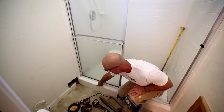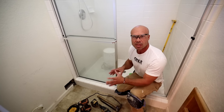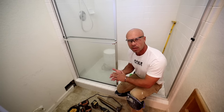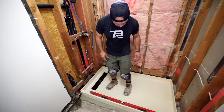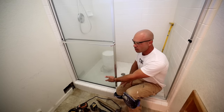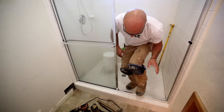What it also does is it'll crack the tile on the curb or the grout because the 2x4s making up the curb get wet and they swell - the tile can't give and it cracks. When we rebuild this, we're going in with a sealed system that has waterproofing directly under the tile so we don't get that wicking action. With curbs, I do not prefer wood curbs - I like to use either masonry or foam so that even if it had a little bit of water on it, it's not going to expand and ruin the whole installation. And you also tend to get mold at the floor wall connection with these water in, water out systems.